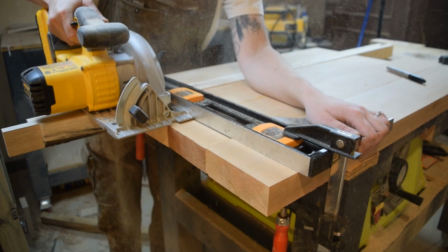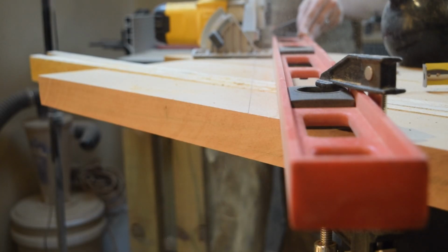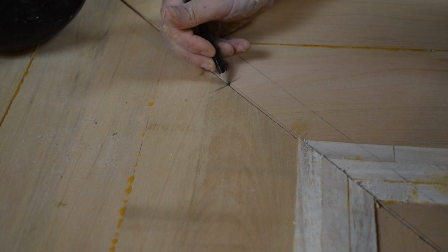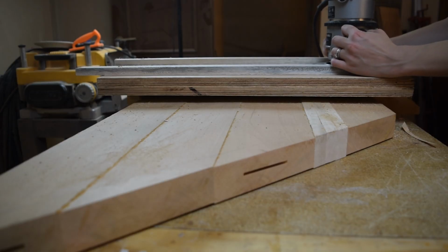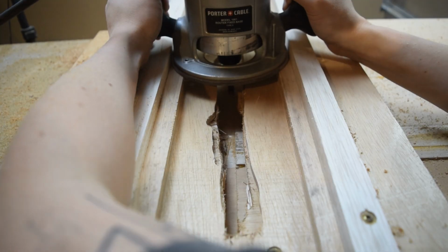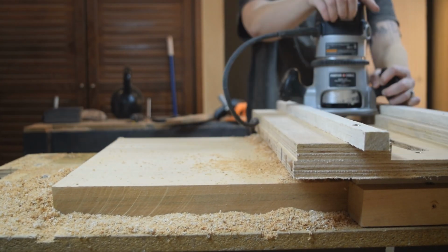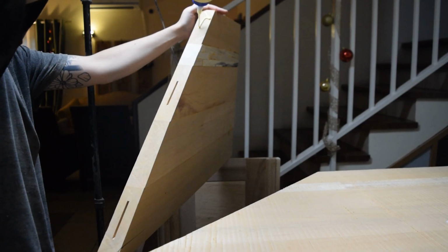Once glued, I trimmed each panel down to size, again cutting one edge of each at the 45-degree miter. Then marked and added slots for placement biscuits. But before creating the L shape, I ran each piece through this router contraption to level off the countertop and make finishing work a little easier. Then glued them together.